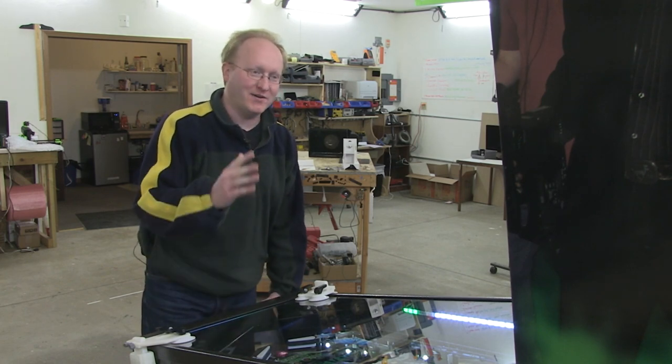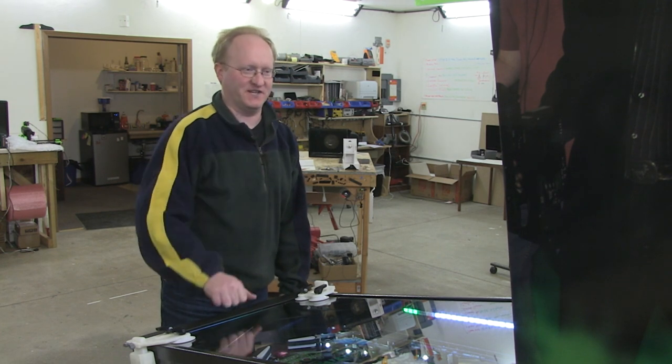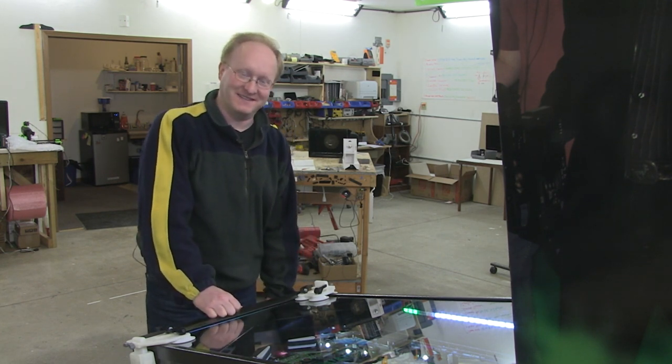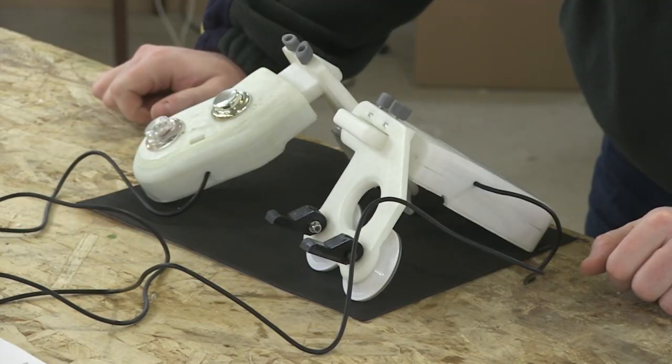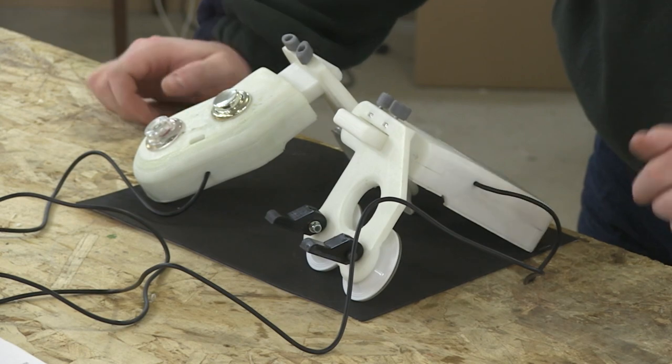I actually defeated a couple of ghost bosses on America's Most Haunted. In today's episode, our challenge was to enable a person to play pinball with a single hand. We accomplished this with suction cup mounted 3D printed enclosures and digitally controlled button duplicators. There is about 83 milliseconds of lag, which we could probably remove with a discrete logic solution or better gearing on the motor. This project took a lot of 3D printing — we spent far more time designing and building the enclosures than making the circuit itself. How did you like our approach? Let us know on the Element 14 community.